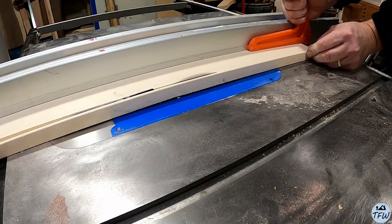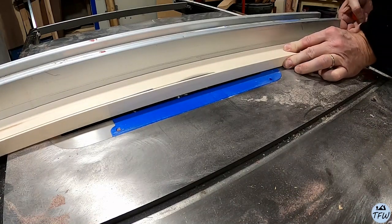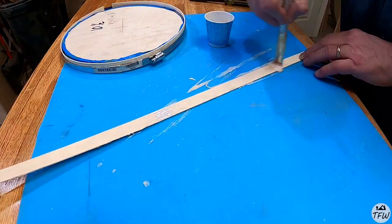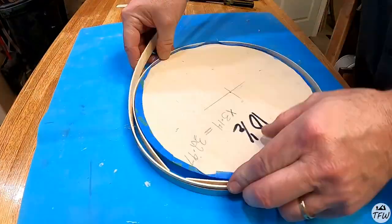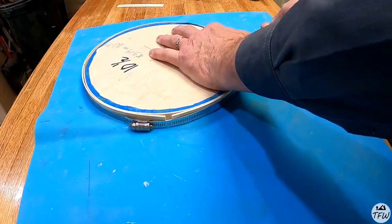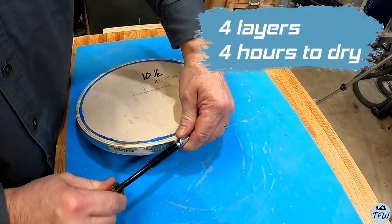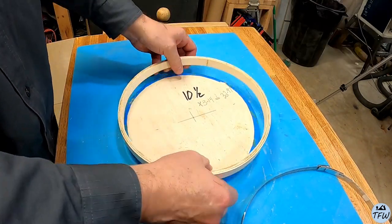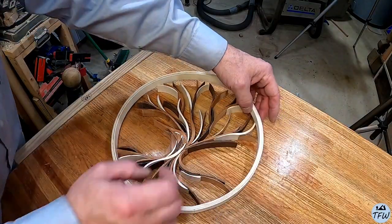But I like the idea of putting it inside a wooden hoop that I'm going to make myself by cutting a round form out of plywood, and then taking some thin strips off of this piece of aspen that I had in stock — it's a very light colored, soft wood, easy to bend. I'm going to layer up four pieces in total on this little round form and use a couple of long hose clamps to lock it all into place, one layer at a time. After it all dried, it slides right off of the form, of course, with some painters tape on the form to help it slide off.